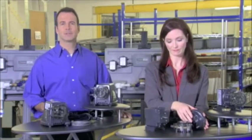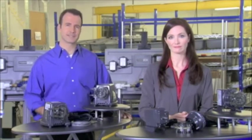A common feature is the peristaltic pump head, which provides the customer with several benefits. Stenner's peristaltic pump eliminates downtime due to the loss of prime from off-gassing solutions such as hydrogen peroxide, so you don't need a degassing valve, which can be troublesome and add to the cost of the pump. That's right. There's a three-point roller design in the pump head, which acts as a check valve to prevent backflow, siphoning, overdosing, and a loss of prime.